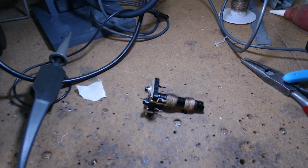So all my radios run on 24. All my aircrafts, they're all 24 volt filaments, because that's my power supplies. I can move my power supplies around. And the guy really, really bodged the audio section. Oh, it's amazing. I'm like, that's going to be a total rebuild. And I'll probably, after I look at what he did, go looking for that article, how to squeeze a little more audio out of the radio. No, what you want to do is properly match the audio transformer and get a good speaker, and you're done. Okay, but no, they basically, yeah, cut this out, add this capacitor, change it.